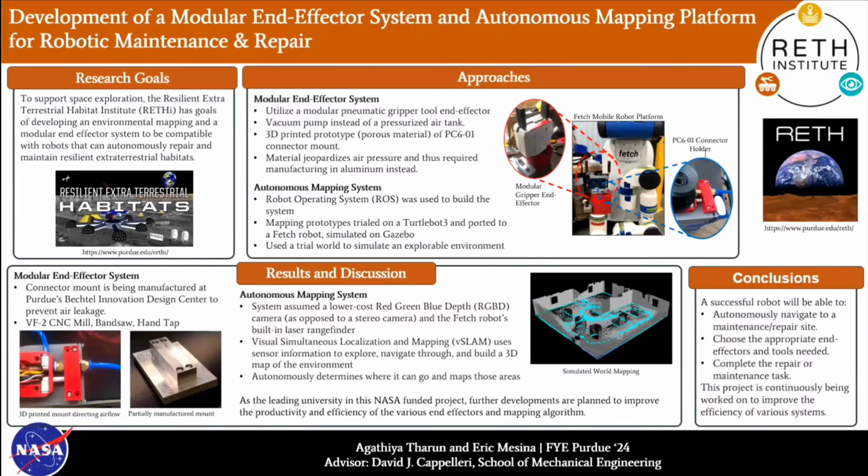The Fetch robot, being much larger than the Turtlebot, often had trouble navigating the tighter spaces such as thin door frames. Some changes, especially to the parameters that decided the robot's size or footprint, were vital to the system. These were all obstacles to the seamless mapping of the environment, and there is much more depth to cover in the robot's evaluation of its environment.